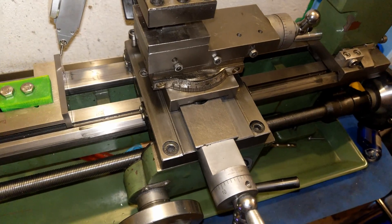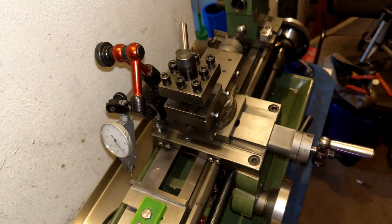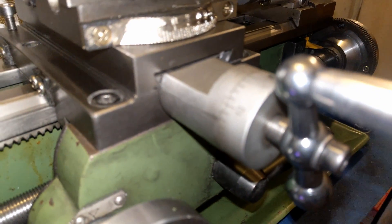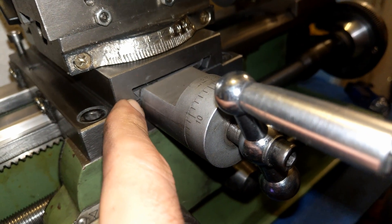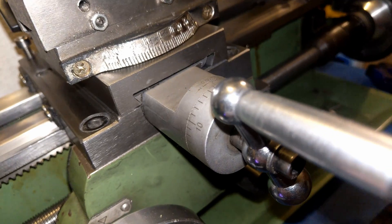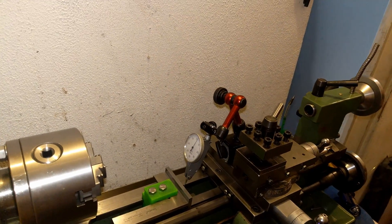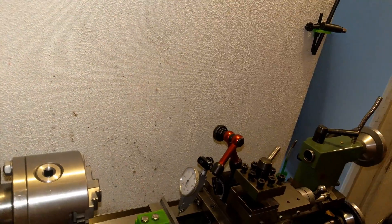It's about one hundredth of a millimeter with the cross slide all the way to the end — I think I nailed it, very happy with the result. What I'm showing you is that these two edges are perfectly lined up. Before, there was a lot more gap between the dovetail male and female sides; now they are laying right on top of each other. If you got something from this video, please give me a like, leave a comment, share it, and if you're new to the channel, consider subscribing. Thanks for watching.